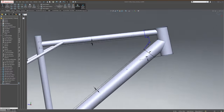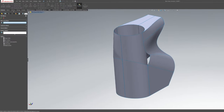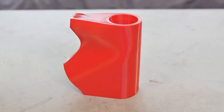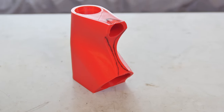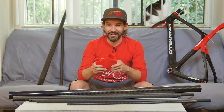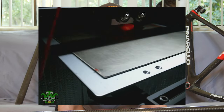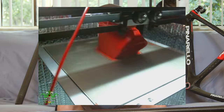I started with the head tube. It took a bunch of tries and trial and error to figure out how to actually draw a part like this, and here's my first part. It's not great, but it was good enough to print, and from the first print I can fit tubes and start to see in real life how I can make things better. I'm prototyping all these parts in ABS because ABS is cheap — much cheaper than the actual carbon fiber material I'm going to be using. ABS also has similar printing requirements to polycarbonate in that it requires an enclosure and high temperatures and is subject to warping, so it gives me an idea of the challenges I'll run into with the actual material.